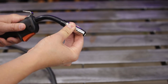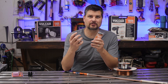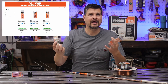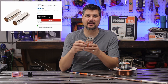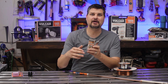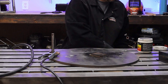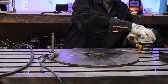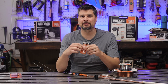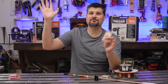The little things like your contact tips and nozzles are specific for the type of welder you have. Yes, there is some overlap between different brands, but they're not that much cheaper online, so just pick up this kind of stuff while you're there and you won't have to worry about compatibility. If you get the nozzle gel — link in the description — Harbor Freight doesn't carry it, so you've got to pick it up elsewhere. It will prolong the life of the nozzles and the contact tips like tenfold.